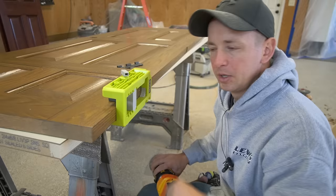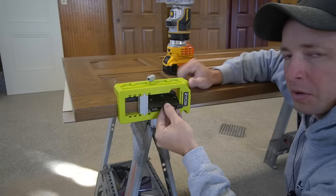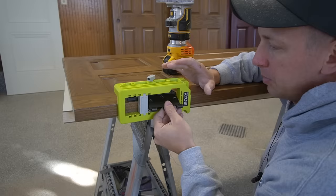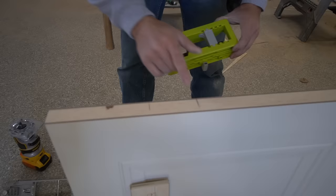That's actually really good — I was just lightly taking a little bit of the old stain off, so we're going to go with that. One thing I can see right away: with my other professional grade template I have it set so it's about a 32nd over the hinge size, which gives room for paint build-up and a little wiggle room. But this Ryobi template is about a 16th oversized — a little more sloppy than I'd like — but we'll see how it turns out.